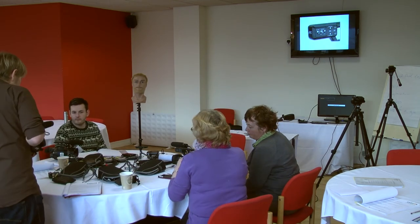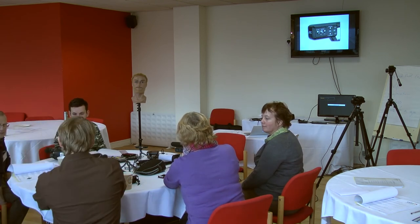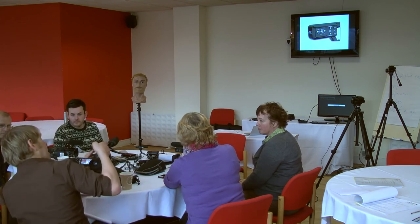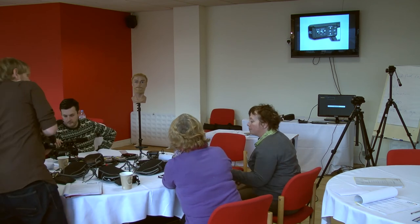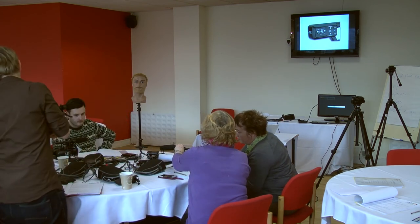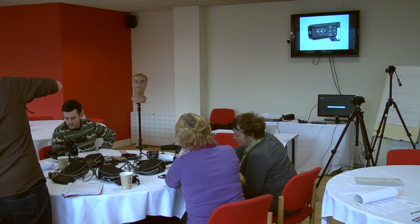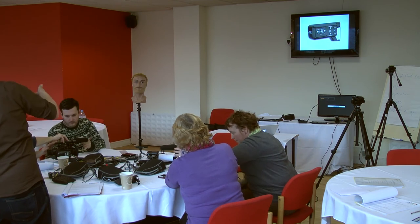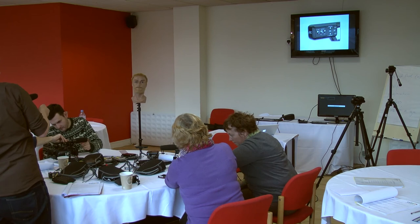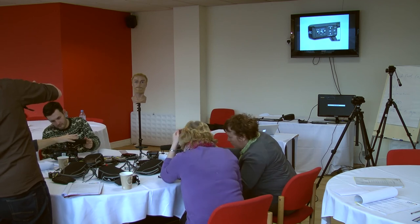To set your levels, what you need to do is, if we put channel one onto manual, you've got a dial here. If you switch that onto manual, have you switched yours? So just here, put that onto manual. And you've got this dial here that says channel one. So if I turn that right the way down to zero, nothing's happening. Just tap on your mic. If you turn it down to zero and then tap on your mic, you should get no reading. And then if you slowly increase that volume and tap on it, it's starting to get a signal.